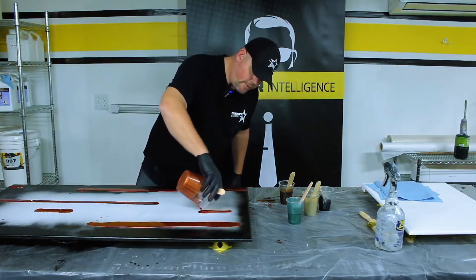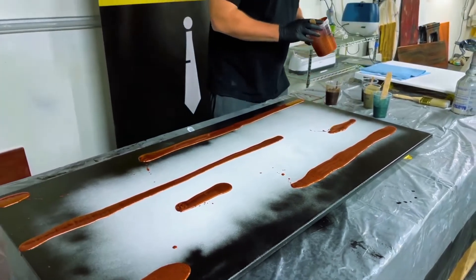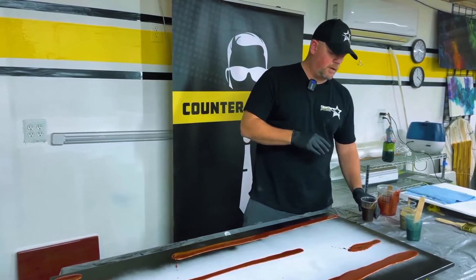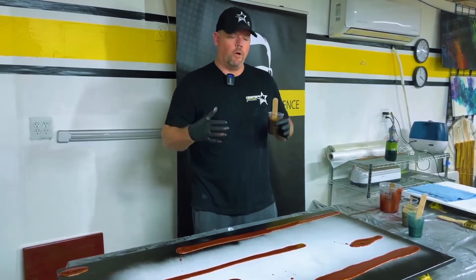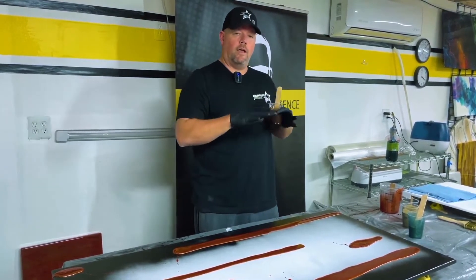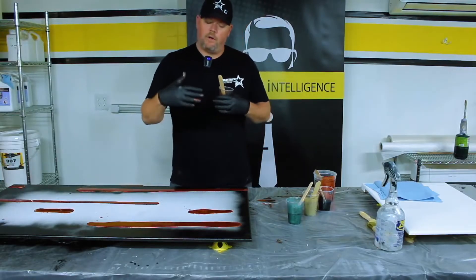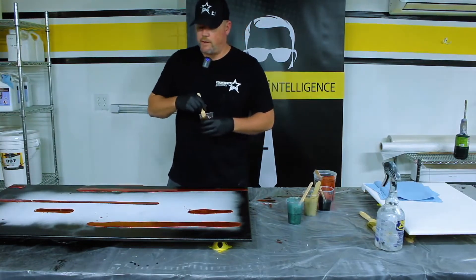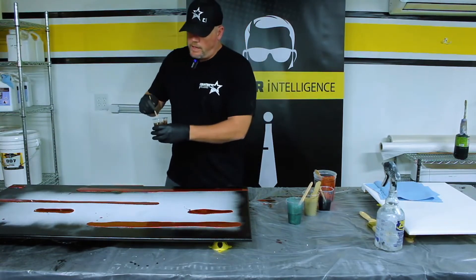For this particular technique I like to use about three and a half ounces of epoxy per square foot. You can go up to about four, but I really don't recommend going any heavier than that. The more epoxy you pile up, the further it's going to walk as it starts to level out, so you will get more distortion. The thicker you put this on, it'll travel and your lines won't be as crisp and clean.